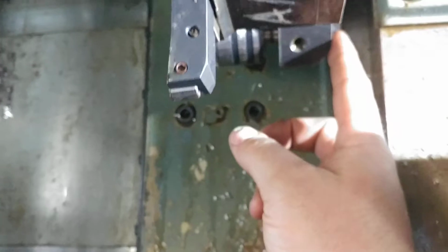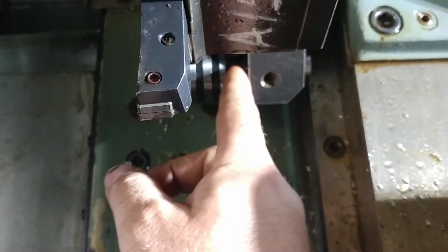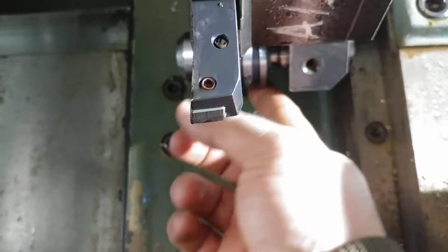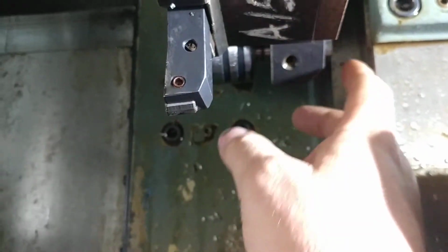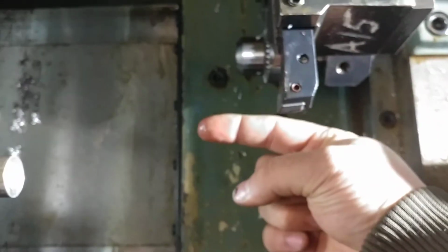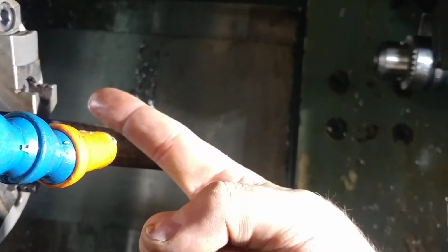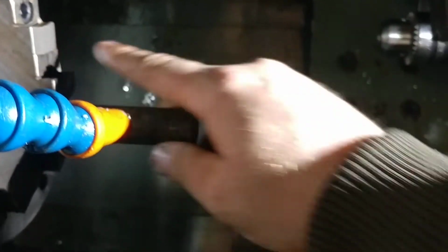So that was a great idea, but this was crooked. So I made this arbor in this lathe, but essentially this was crooked. So I made a couple of arbors and put them in here, and they were sort of cockeyed this way. So when you would bring it in, the drill bit was trying to drill like this instead of straight in like that. So I ended up putting a boring head in the drill chuck and just manually pulling this in.